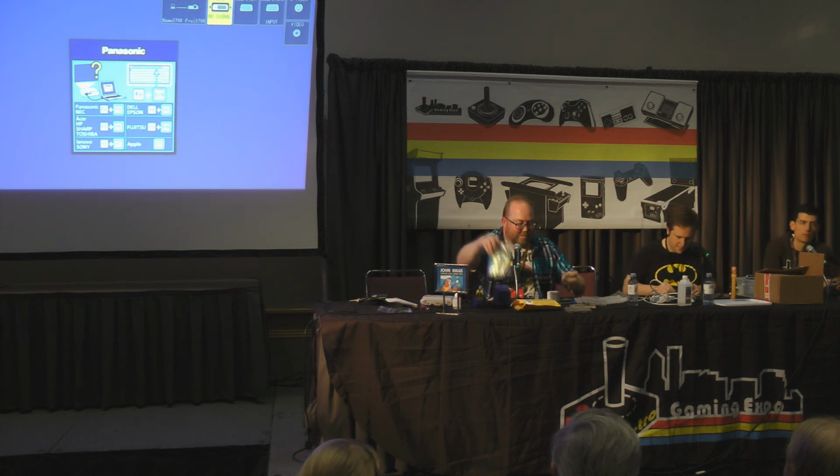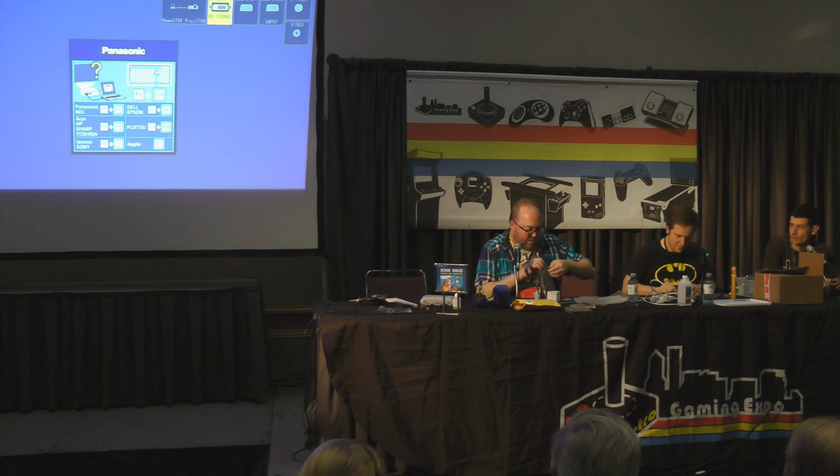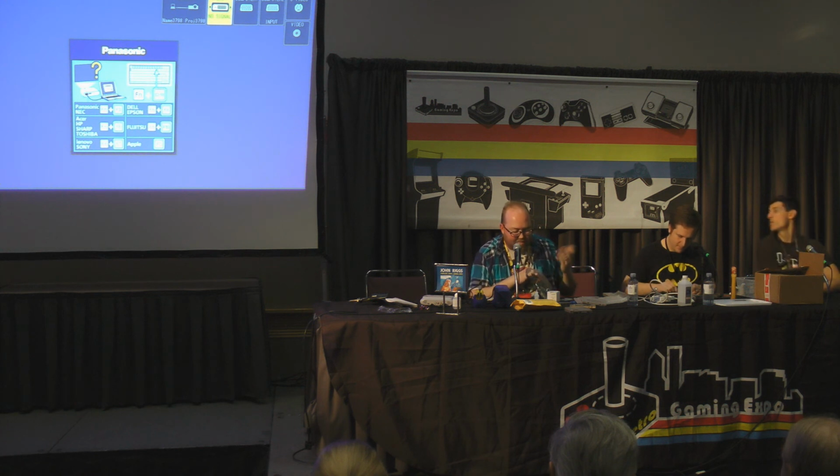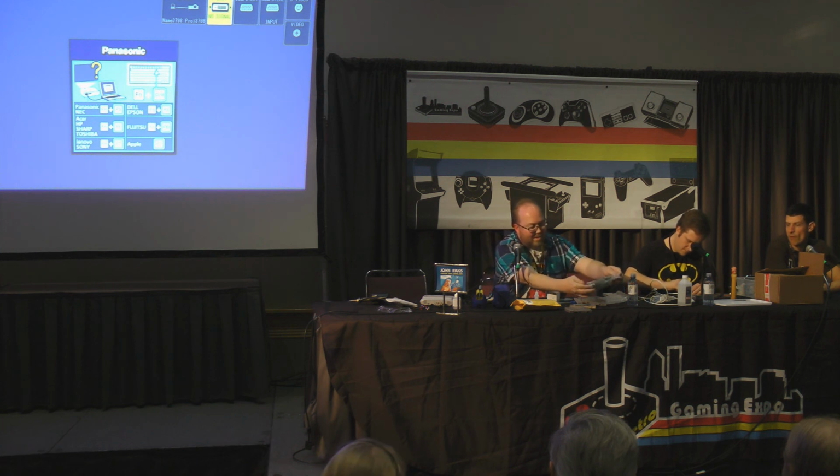I think I have replacement boards. Super Nintendo works differently, where even if it doesn't look exactly like this, the key to the Super Nintendo, there's an A or a J. So I have to make sure the replacement board is the same. So this is a game with an A. Most games are A. A couple of them have J's. The difference between A and J is high ROM, low ROM, and the difference between that is I have no idea. That's what I look out for.